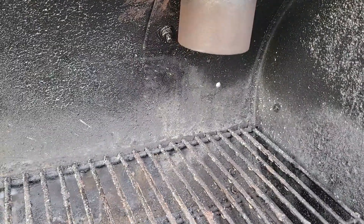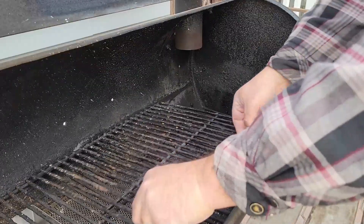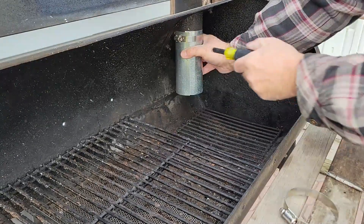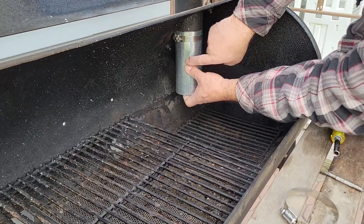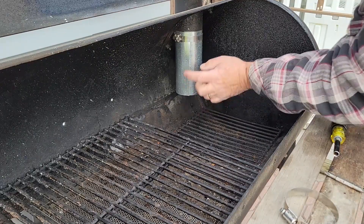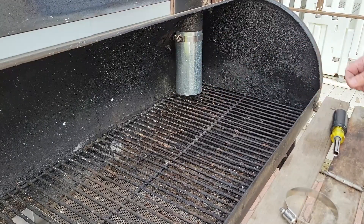We'll see how it works. If it doesn't stay on I can make a longer one that'll give it more engagement. I took some sandpaper and got all the creosote off, so it's ready to apply the smoke pipe extension. Not too bad at all — even lines up halfway decent. I'll get my drill and pop those two holes in for the pop rivets, then take it back to the shop, put in the rivets, and slide it back up on there. You can see it's a bit too high above the grate right now — I'll bring it down once it's riveted together and then we'll have grate-level smoke evacuation.